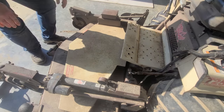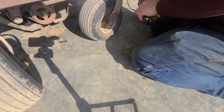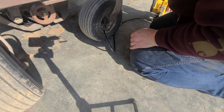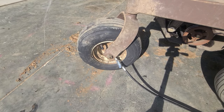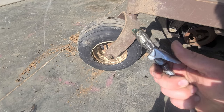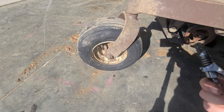All the idlers are sealed, so there's no zerk on those. That is the front end of the mower — now let's head to the back. As with the front, there's no zerk up here either, so there's a sealed bearing there. We've got one around the axle underneath there. I highly recommend this fitting on a grease gun — you squeeze it, let it go, and it locks on. Awesome, super helpful — wouldn't use a grease gun without it.